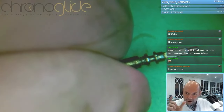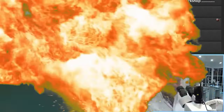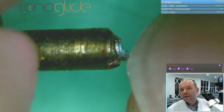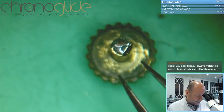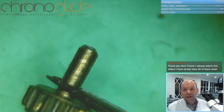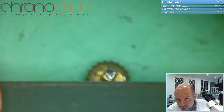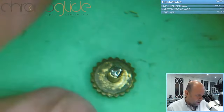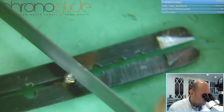Now I'm going to snap it off so short that I cannot use the pin vise to twist it out. I just slipped this off, and you can see it's not big enough to grip with the pin vise — nothing to grip. It's a bit more flat now and there's no hope we can grip it with the pin vise. What we have is a very thin file — a screw slot file — to make the screw indentation.